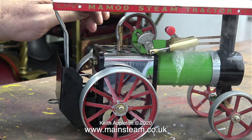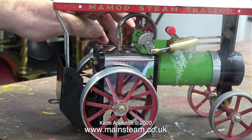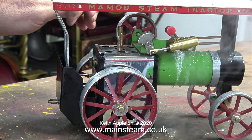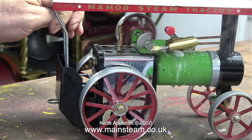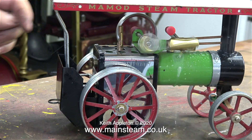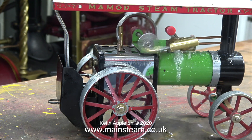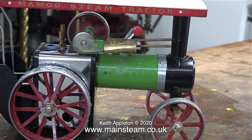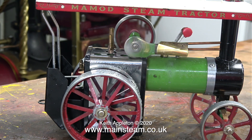As the steam pressure opens the safety valve, steam comes out to atmosphere followed by a lot of water. Why is this? Is it because there's too much water in the boiler? No — it's called priming, and this always happens with new boilers. This boiler was soft soldered together at the factory many years ago, and even though after soldering it was probably cleaned, there are still some impurities inside the boiler that have now been transferred into the water, and when the water boils it's unstable.